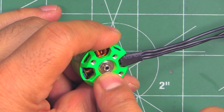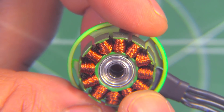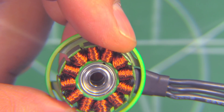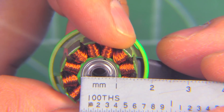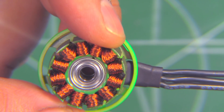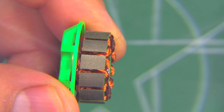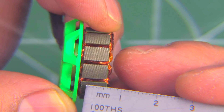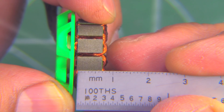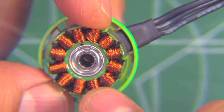Let's take out that circlip and put it under the magnifying glass so we can see detail of the stator and magnets. Here's the stator — as you can see, that's a 4x9x4 bearing. They went with the beefy bearing, which is known to be more durable and much preferred by FPV pilots who like to abuse their motors. Bigger bearing lasts longer. It looks like 0.2mm laminations — pretty much standard these days, though some use 0.15. The stator height is 7mm nominal, and the windings appear to be multi-strand.